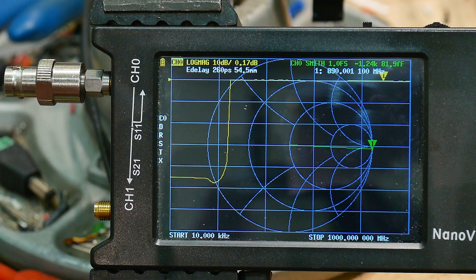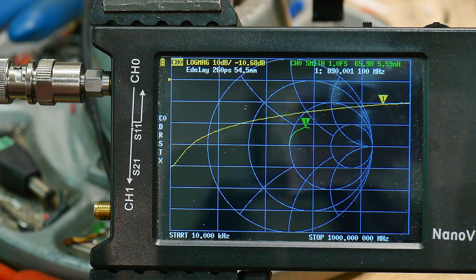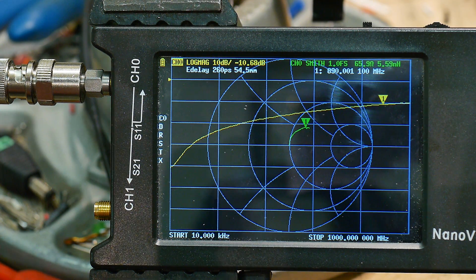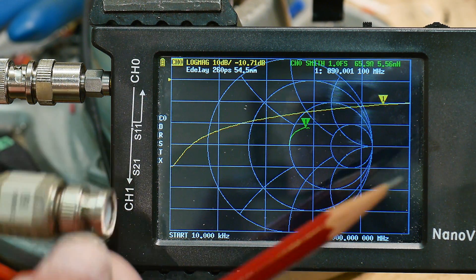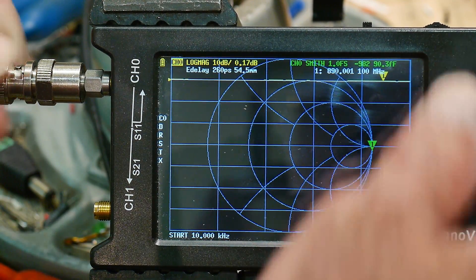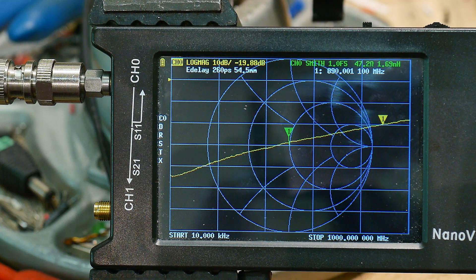In the past I was using the generic ones for 50-ohm calibrations, and yeah, they're not all that nice. There's definitely a difference between 50-ohm loads made for audio or up to maybe a megahertz, versus proper RF ones. Even the cheap ones seem to operate to around three or four hundred megahertz, so they're still pretty good into VHF — but definitely falling apart at UHF, definitely not good at a gigahertz. I was also impressed by the oscilloscope 50-ohm loads — I have no problem using them up to a gigahertz. So: 50 ohms is always 50 ohms, except when it's not.